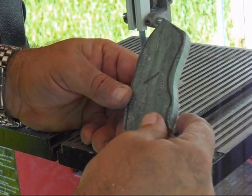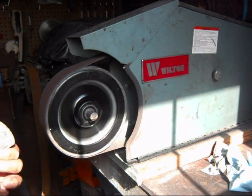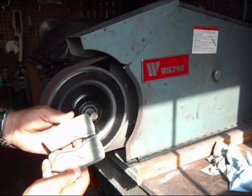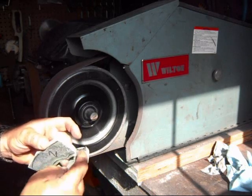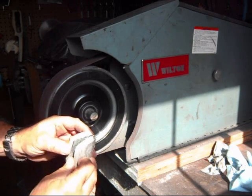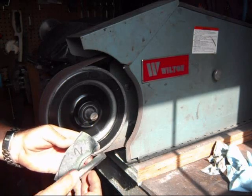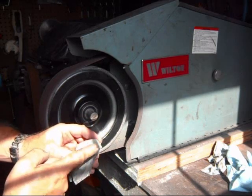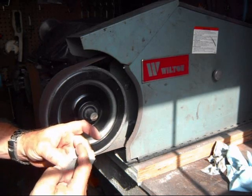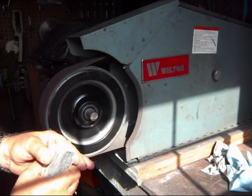to number 2 and move on to the next step. The next thing I want to do is clean up the ends here, smooth them out a little bit, which I've done with a 50 grit belt. Now I'm going to use a 220 grit belt, and that'll be enough. After they're attached to the knife and then you thin that down, it's kind of tough to do anything with that edge. So do that before you attach it to the knife.